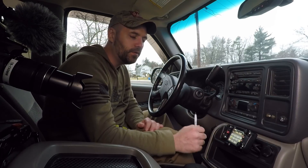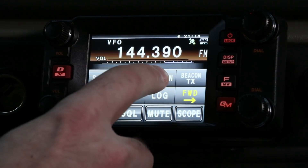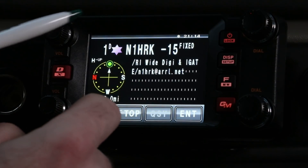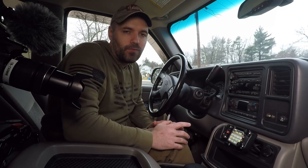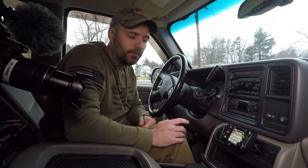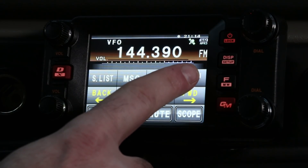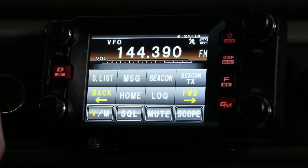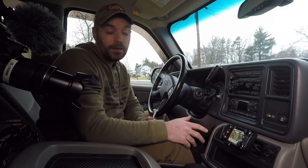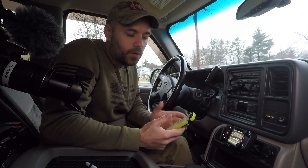Back on the main screen — if you run into an issue where your beacon logo is not showing up, this beacon button is how you turn that on and off. A simple click of that and you'll notice every time I click it the beacon transmits. Also, if your buddy asks where you are and your beacon is set to 15 or 30 minutes out, you can go to the beacon TX button and click it to actively transmit at any time. You could transmit every five seconds if you want, but you'd drive people crazy.